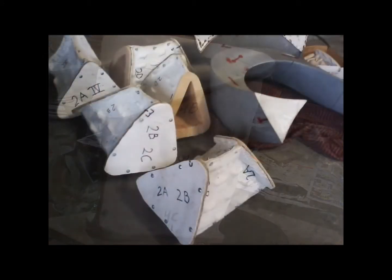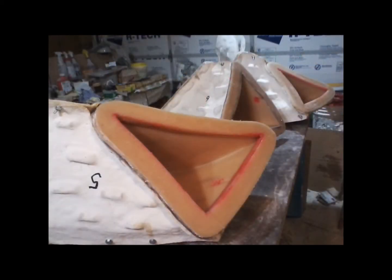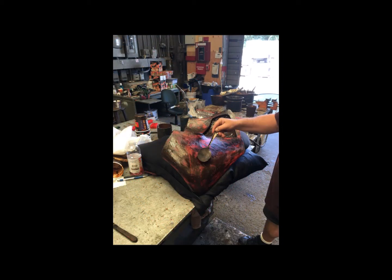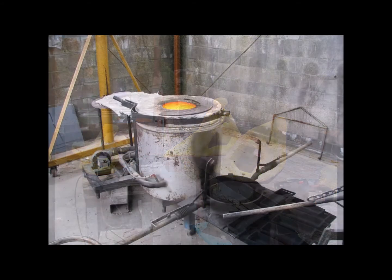These 28 sections were brought back from the mold maker to the foundry and we started to put wax in and out of the sections of the mold so that we get a thin, three-eighths inch thick skin of the pattern. Those waxes then get treated and invested in ceramic shell, which is what we pour the hot bronze into.